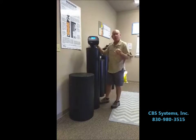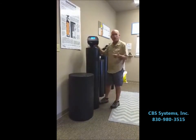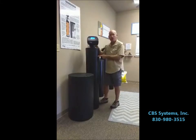Because the demand of water each day and the grains of hardness that you're trying to remove are all factors in sizing the correct equipment. So first we need to know how hard your water is, how many people are in the family, and then the third parameter is flow rate.